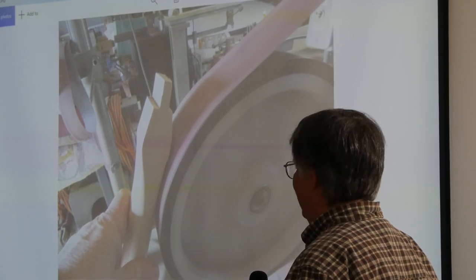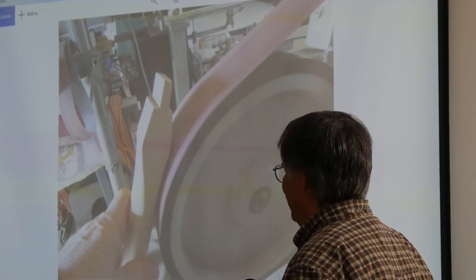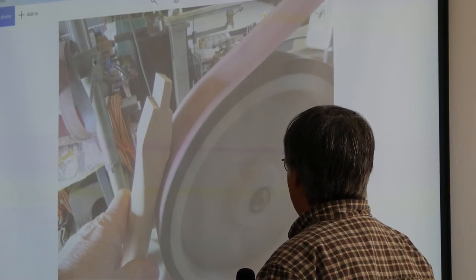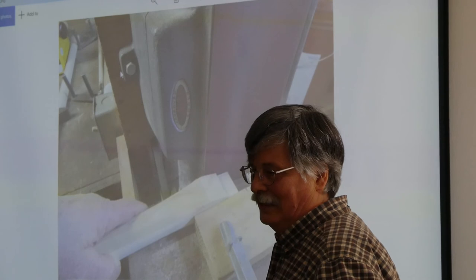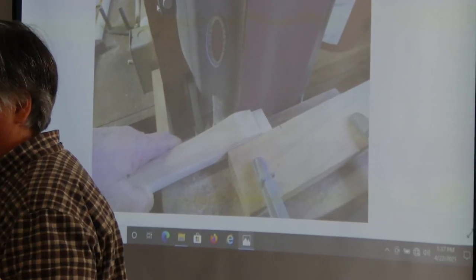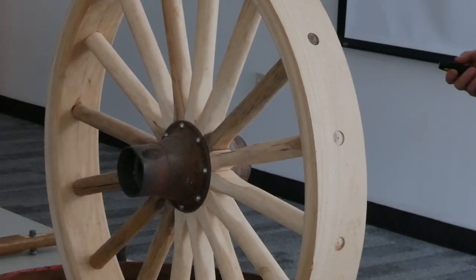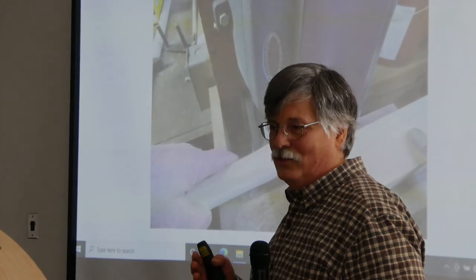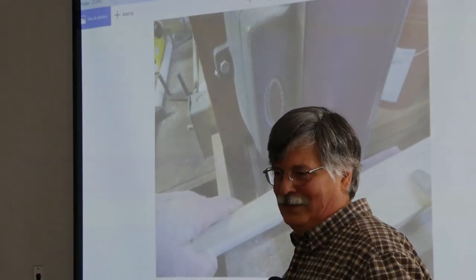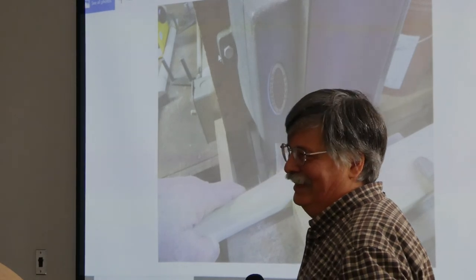The spokes needed a little sanding; they were a little rough on the way they come. You have to put an angle on the spokes — the spokes are actually stuck into the hubs at an angle. There's a dish to the wheels. Most wooden wheels have a dish that gives them strength for a sideways force. Because if they were just straight, a sideways force would just cause the wheels to collapse. But if the spokes are in a cone shape, when the force pushes sideways, it won't break down.